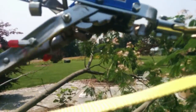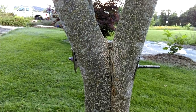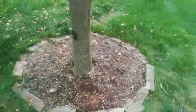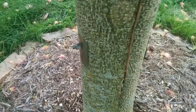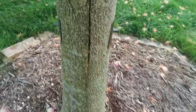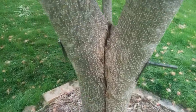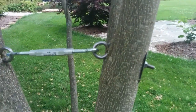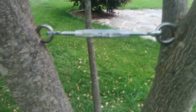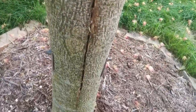The neighbors are not around at this moment. I fashioned these out of stainless steel using 3/8 threaded rod. I'm very happy with this. There's a bolt on one side going through about 18 inches up from the bottom, and then I got a second one right at the joint where it's split. And then some eye bolts and a turnbuckle up here a little bit further. As you can see, I've got the gap down to about an eighth to a quarter of an inch.